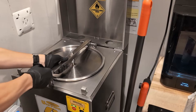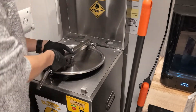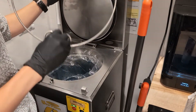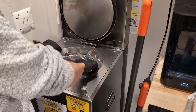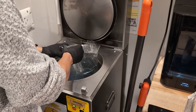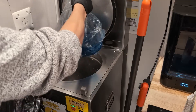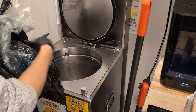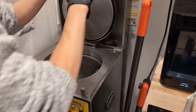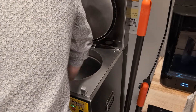Here I am coming back to it the next day. Recycling cycles take around six to eight hours, so it's usually just a day or overnight thing. You take the bag out and you can see there's no more liquid in the bag, but there's all this junk — that's essentially the monomers left over after the distillation process. After you boil away all the IPA into vapor and condense it back down into a liquid, that's what you're left with.